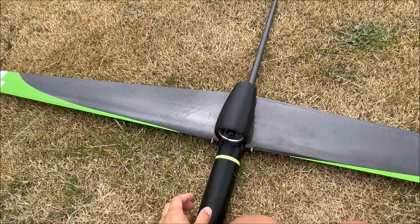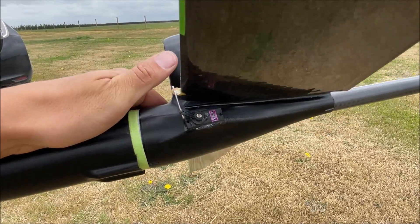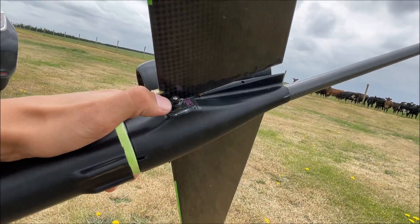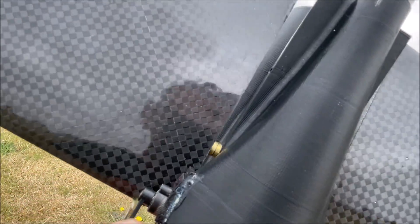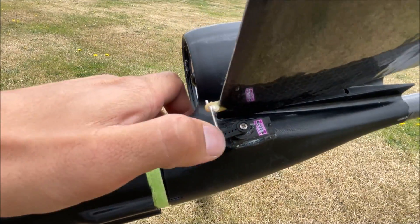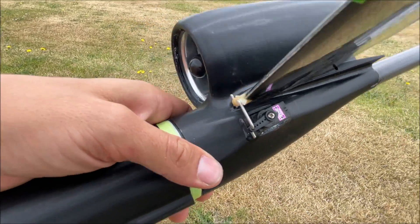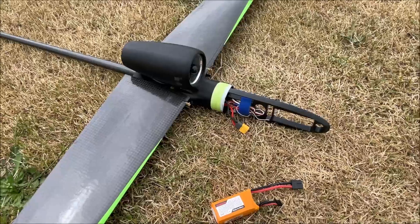That's my little secret. As you can see in the servo slots here, I have just two servos on this aircraft — only those two. I have not used the pinholes; instead I used a brass sleeve with a seven millimeter fiberglass rod going through the middle of the eight millimeter sleeve. That pivots quite nicely and I directly linked the servo to the control horn on the leading edge of the wing.